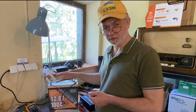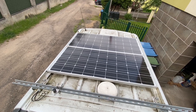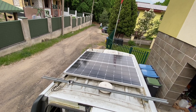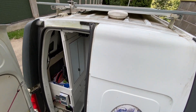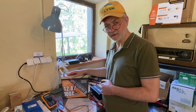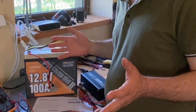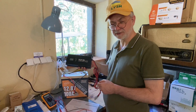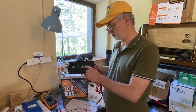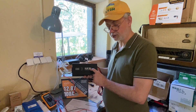If a hand crank generator is your favorite method to charge up your 100 amp hours battery, please leave a comment — I'd love to know. For today, I've got no crank generator, no diesel generator. My solar panel needs some reorganization to be adapted for charging a lithium iron phosphate battery. To use my car's alternator in my camper van, I need to buy a DC-to-DC charger, because a lithium iron phosphate battery requires one to prevent the alternator from getting damaged. So what's left for today is the wall charger from Power Queen, providing 14.6 volts and 20 amps of charging current.